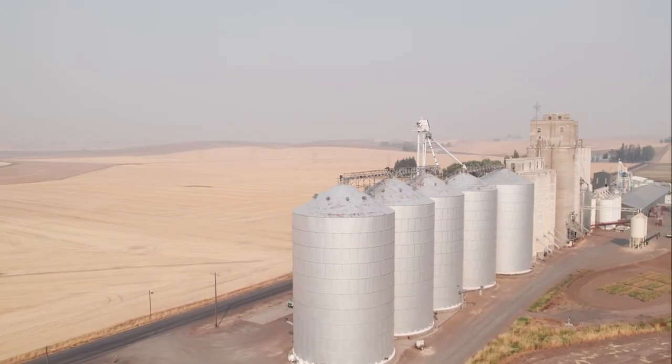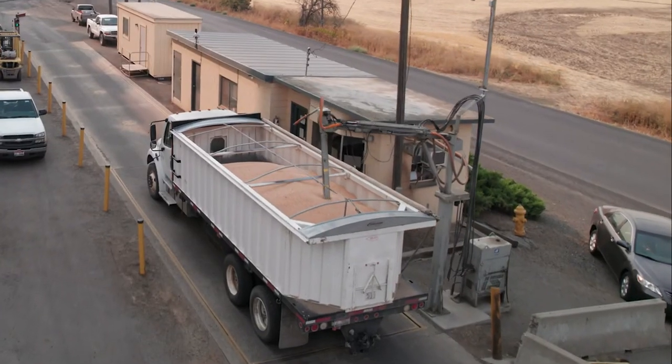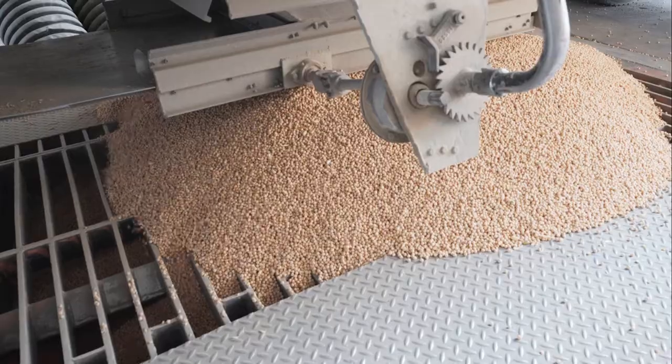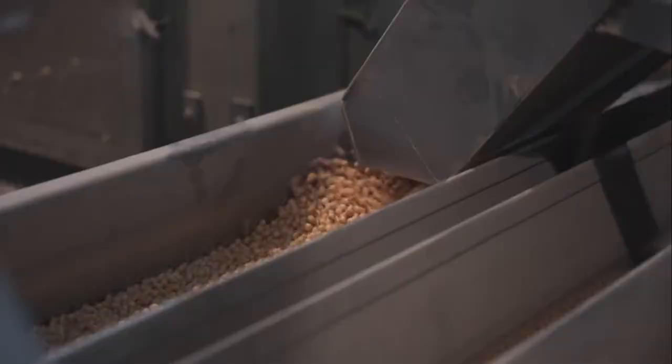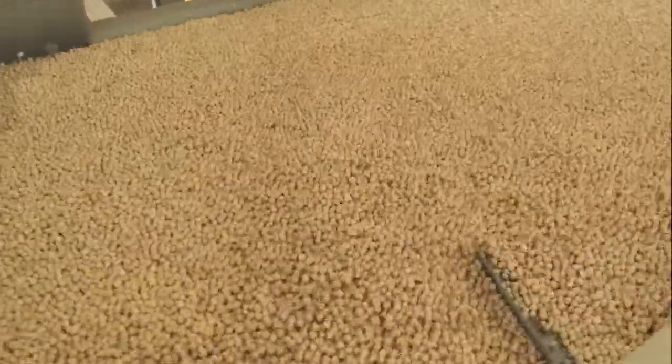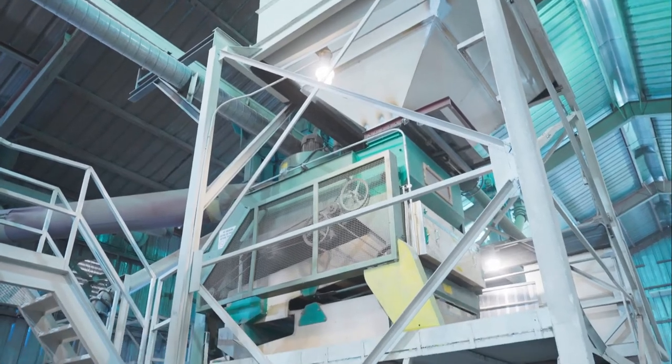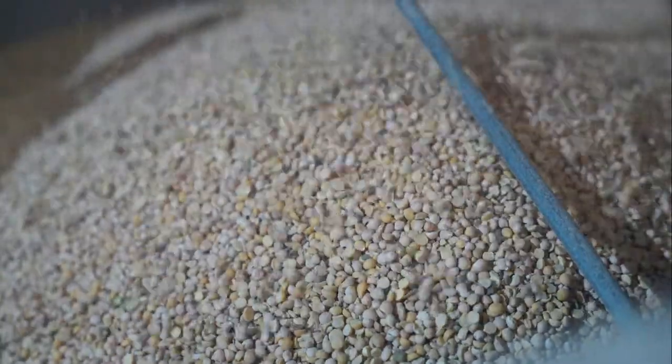Welcome to the Genesee processing plant. Here in Genesee we will process lentils, green peas, and kabuli chickpeas — both large and small. Once we've received the crop into the plant, we start by running it through an aspiration system, then the screen machines, gravity tables, and destoners, before it goes into either precision graders for certain commodities or the color sorter, before going through metal detectors into our finished product.